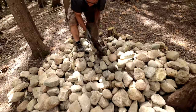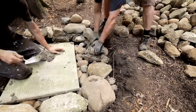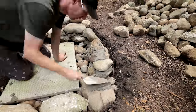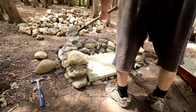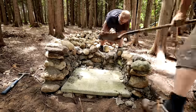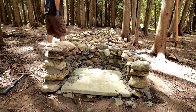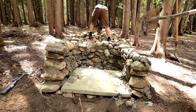We're always looking for the perfect stone — it's always at the bottom. Don, what do you call that fancy pointing tool you're using? Fingers — he's using his fingers to point. The idea behind this rubble foundation: we put the mortar in loose, stack the stone as best we can, and when the mortar gets a little more solid we smooth it out. You can use a pointing tool, or in Don's case, your fingers. Recommend wearing thick rubber gloves because the mortar has lime in it — caustic stuff that peels your skin off. We can only go a certain height today otherwise it'll fall over, so we'll stack a couple more rows to platform height and let it set overnight.